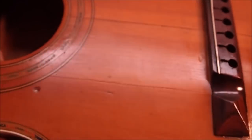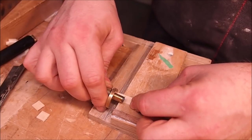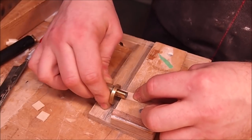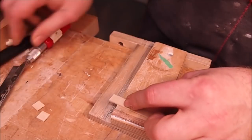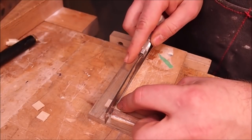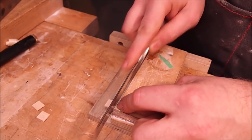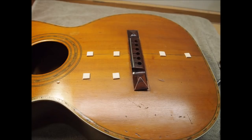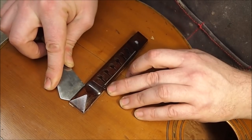I'm going to put some glue in and make the cleats out of some soundboard material — this is spruce. First I score it on both sides with a marking gauge, which gives me a clean line to cut to with my back saw. I run the cleats so that the points are in line with the crack and the grain crosses at about 45 degrees.